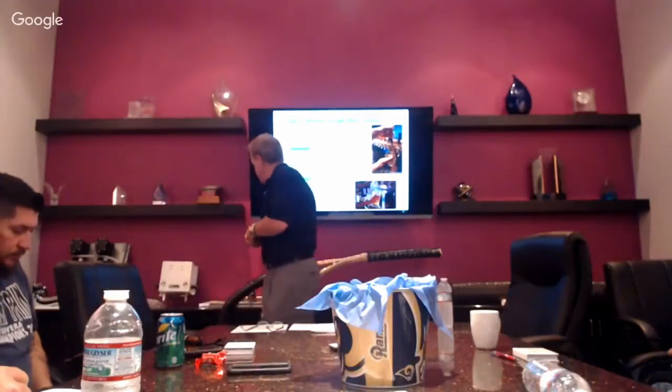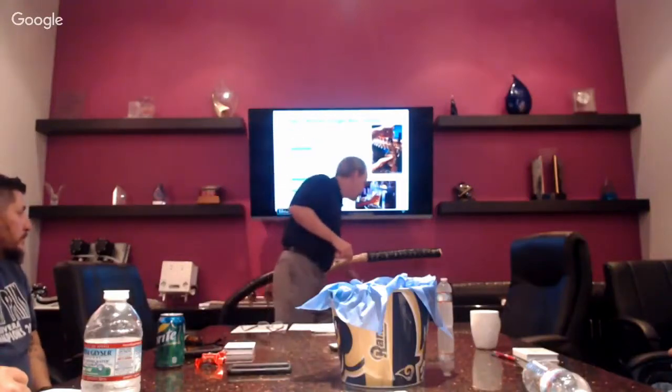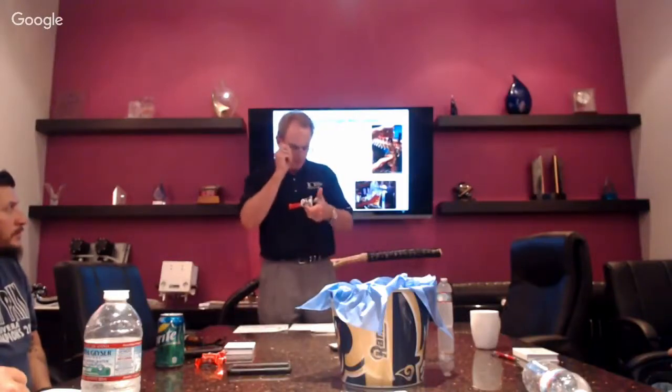The biggest reason is the keg couplers. Is it 50 or 55? It depends on the model. It should say on the tag, but I can see a safety valve on that. Yeah, so there's a safety valve here. You get above, I think it's 50 PSI. They're always on. So this one's 50 PSI, so you can go up to about 45, 47 PSI. If the lift or the distance is beyond 50 PSI, this coupler's not going to work. This relief valve is going to pop and it's going to let it all go. So that's the limit on the blended gas.